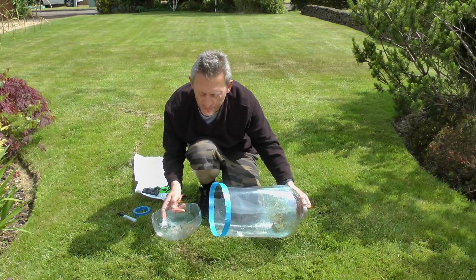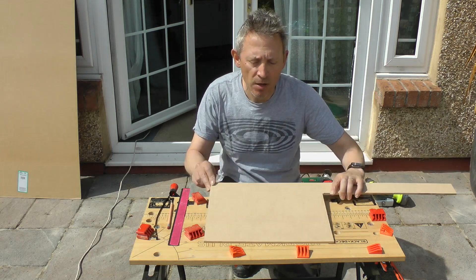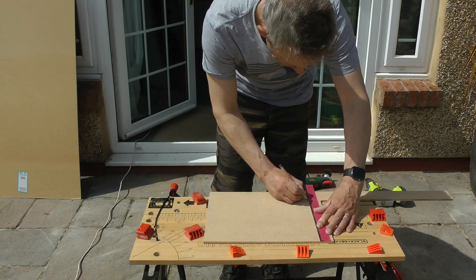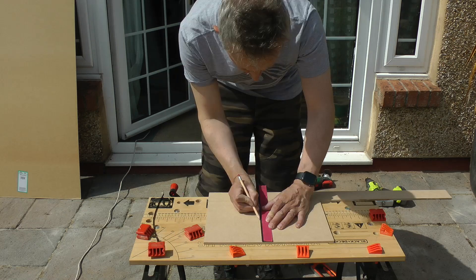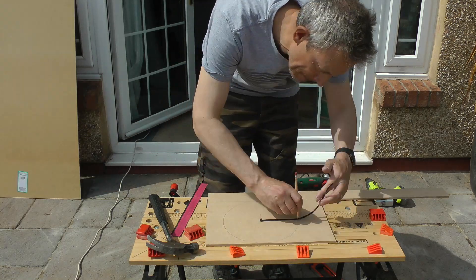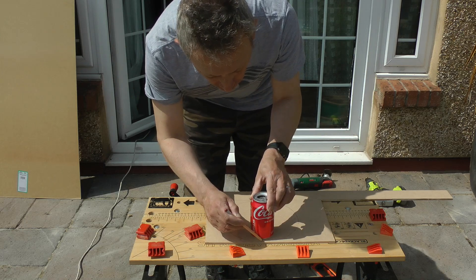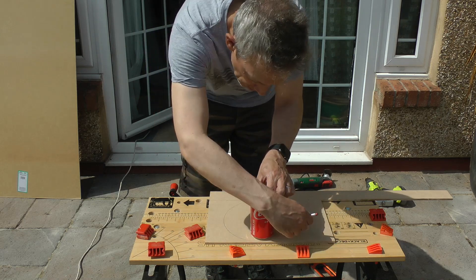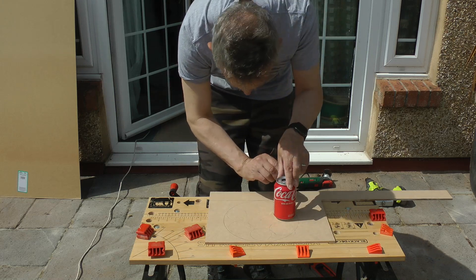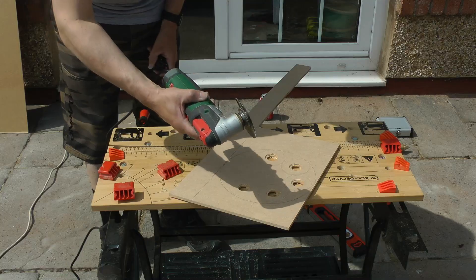With the inner split into two halves, we leave these to dry in the sun. Now with some MDF or hardboard — this is six millimeters thick — we're going to cut two circles, one for each end of the key keg to mount the cans. We're going to cut a circle using a cable tie as a guide. I'll designate this part of the circle to hold five cans facing the sun and just very roughly draw circles to find out where they will be. Then we put ventilation holes in each of these positions, and now to cut out the first circle.